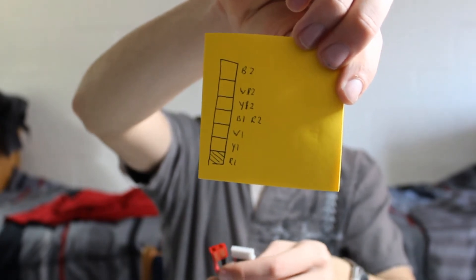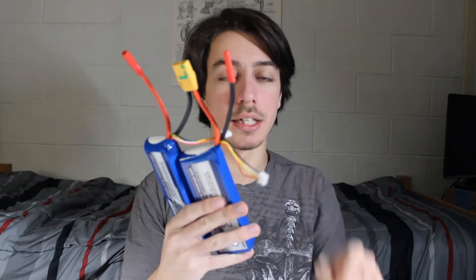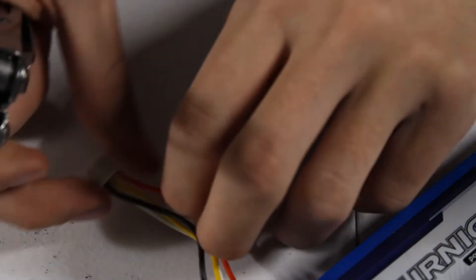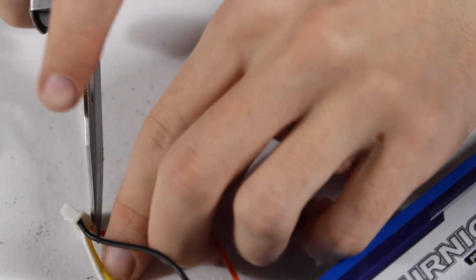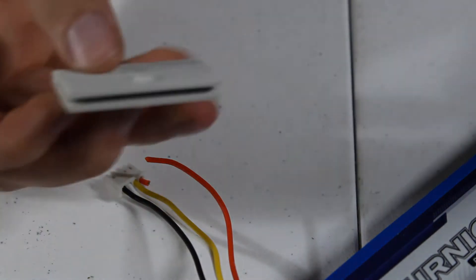The shaded box is the one red cable that I have here. The next thing we're going to do is take our batteries and cut each of these cables, strip them, and then solder them together in the pattern shown previously. The first cable that needs to be soldered is the red one, so I'm going to cut that as close to the connector as possible. Then I'm going to take a blade and roll it along the cable — that will strip the cable easily.